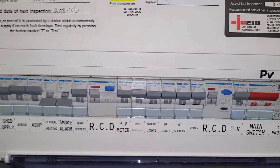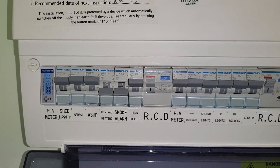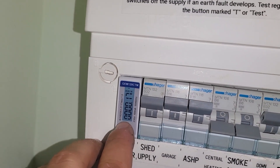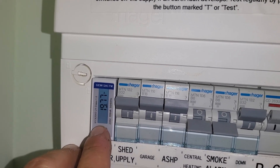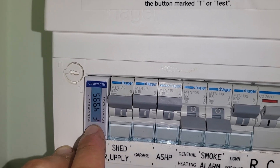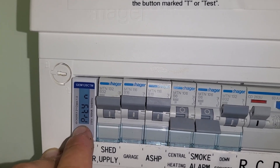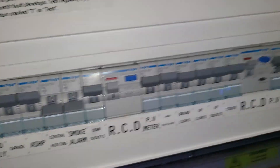You can see that is it all buttoned up. We've got the SPD in next to the main switch, our new C-type MCB feeding the GiveEnergy hybrid inverter, and the GiveEnergy meter tucked away at the end — this actually has lots of information in it. It takes its power from a local MCB just to energise it. The CT wires into the bottom terminals and goes around your line tail, and then there is a two-core communication cable leading off to the hybrid inverter where it transfers lots of data, making it accessible through the app and helping the system work.